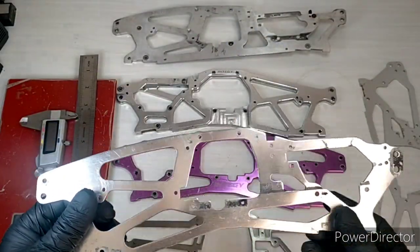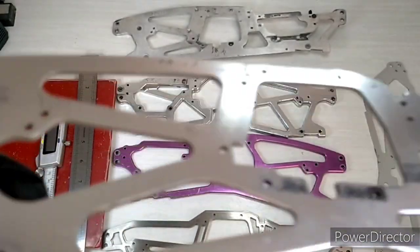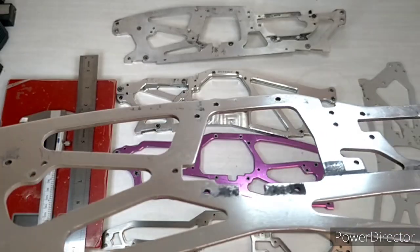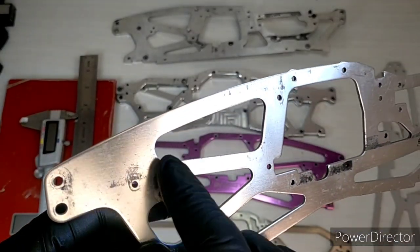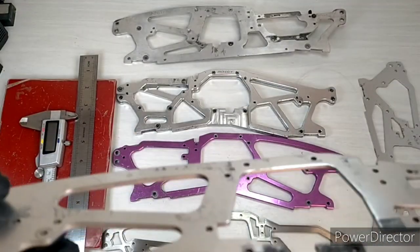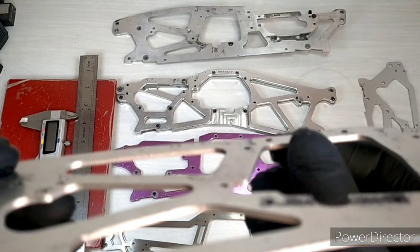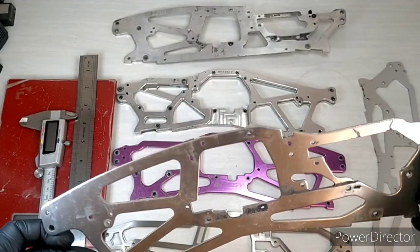So this is a standard chassis which has become bent. It's made from aluminium. If you look carefully it looks to have been pressed out of a sheet, so probably not particularly high grade aluminium. You can see the grain lines showing it's a rolled sheet, and the way the edges chamfer down as the blade has pressed and sheared them off — that rough line where those middle bits were sheared out. So again, not particularly high spec.